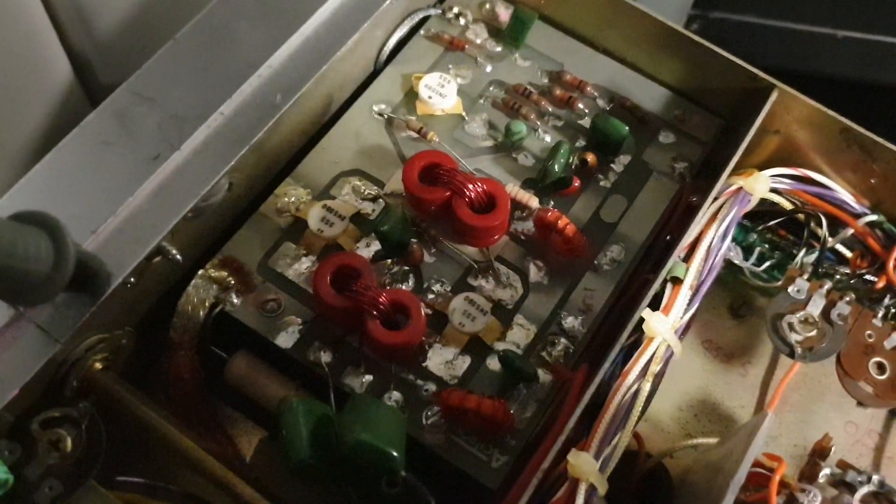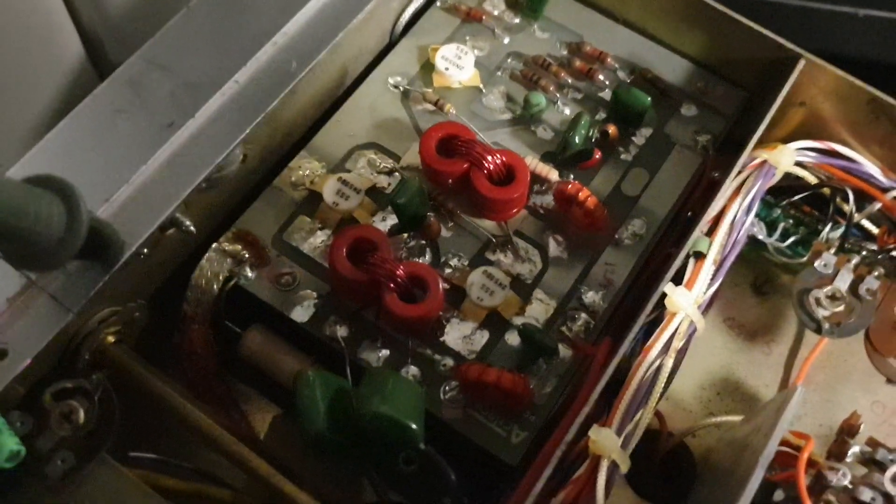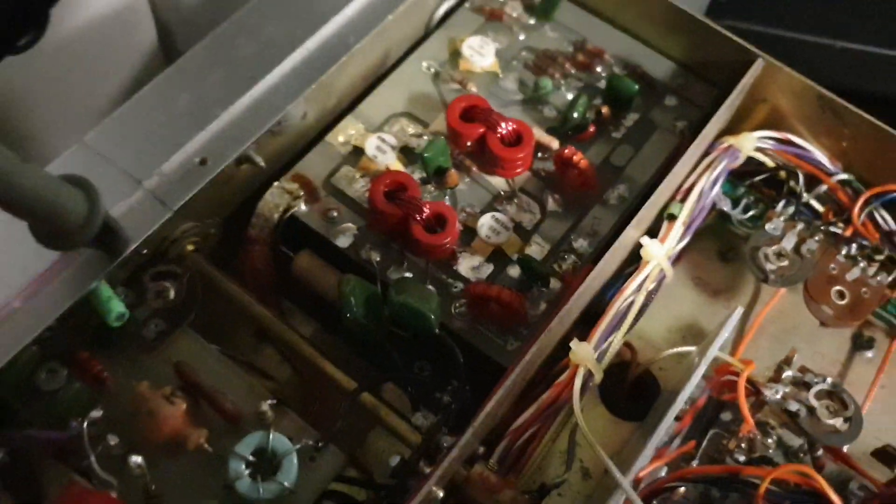Just giving you a bit of a look — this is obviously their set of crystals for each band. It's pretty crude, but remember this is 1969, and for 1969 it's advanced. This is their driver setup — the thing people found hard to believe, because when you take a transistor-based driver section into a valve you've got to get the impedances right, and that's what you're seeing in these areas here.